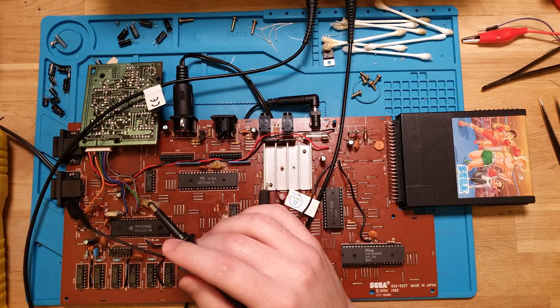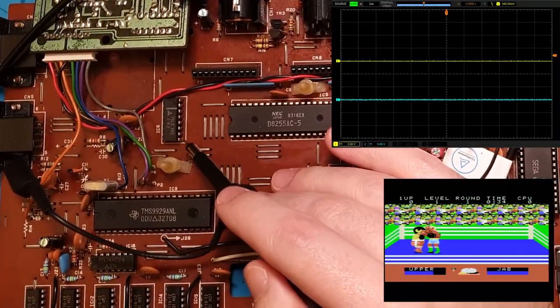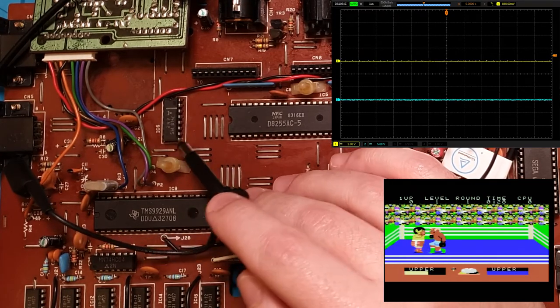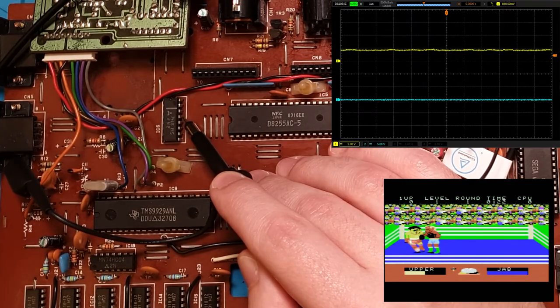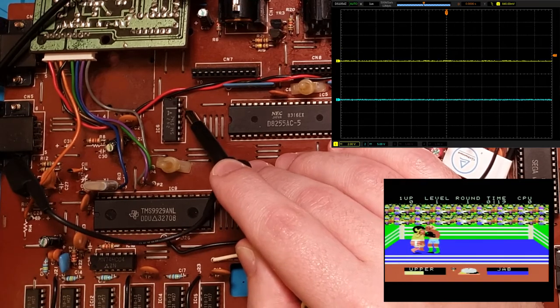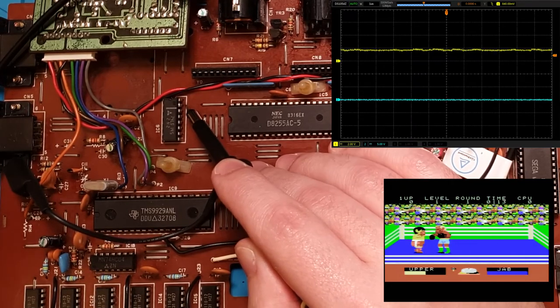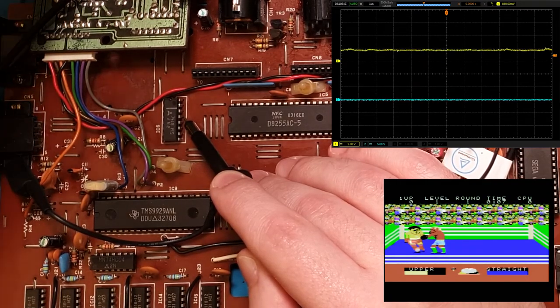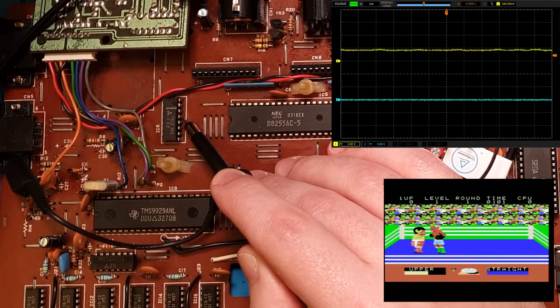Yeah, okay. Well, let's check the inputs anyway. So we want to look at those A, B, C lines, which are on pins 13, 14, and 15. Okay, so 9, 10, 11, 12, 13. So that's 2 volts. 14 is ground, and that's 2 volts as well. Right. And it's not pulsing at all. It's not moving up and down. Yeah, which is...